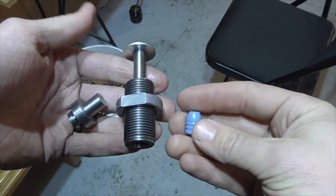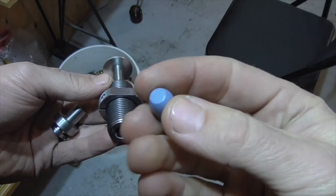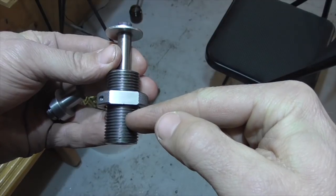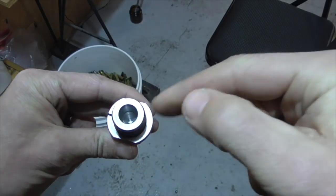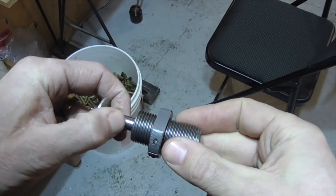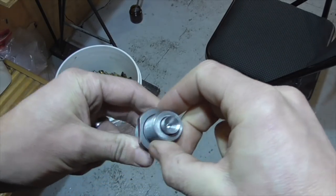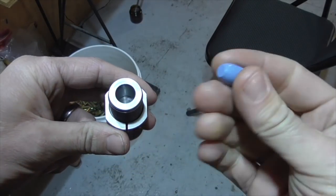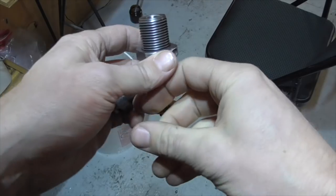This is pretty simple in concept. Here I have just a cast lead powder-coated .44 caliber bullet. And here I have a piece of 7/8-14 all-thread that I bored out to .45 caliber. That bore goes not quite all the way through — it tapers down to a smaller hole at one end to retain this terminal bar with a conical point in there.